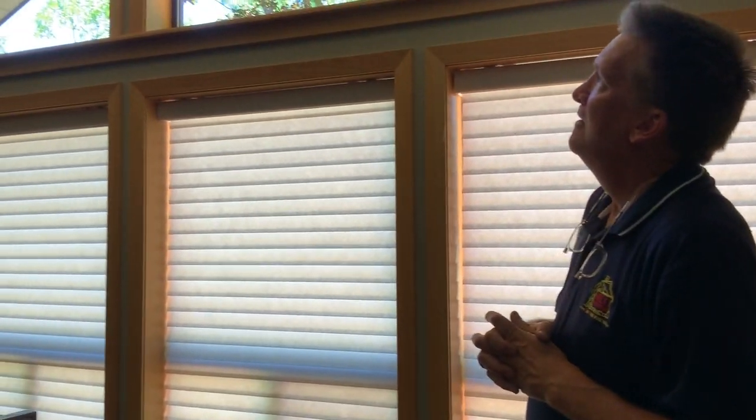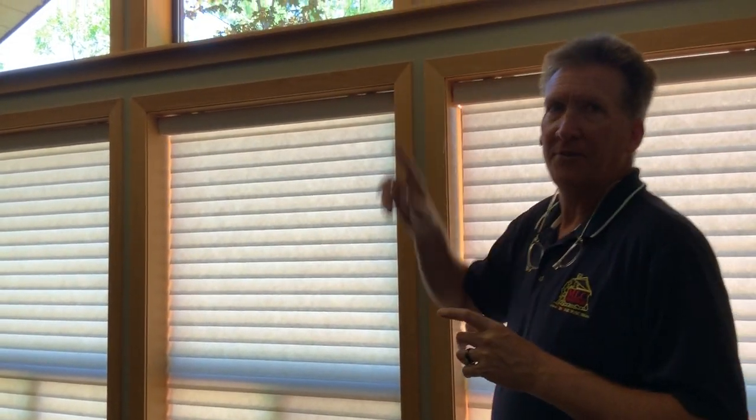Did you look up there and see if there's any sweating on those? There is sweating on these a little bit as well. And because this is a wind-driven side, we have leak stains at our skylights. Yeah, those are for sure. I saw those when we were here too. And I took good pictures of the detailing of the flashing on the outside. They always leak. Unfortunately, they really tried to go to a lot of care with the flashings up there on this newer roof.